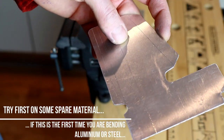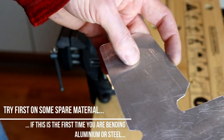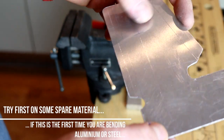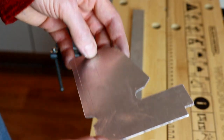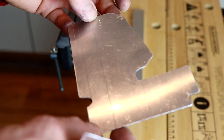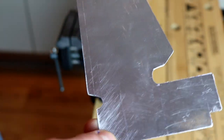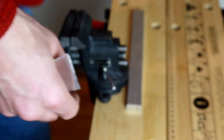The thing you need to remember about aluminum is it's a very fragile material - you can bend it once, sometimes maybe twice, but going too many times is going to weaken it and you'll probably break it or damage the structure, which at best just won't look very good. So let's get to the bending.